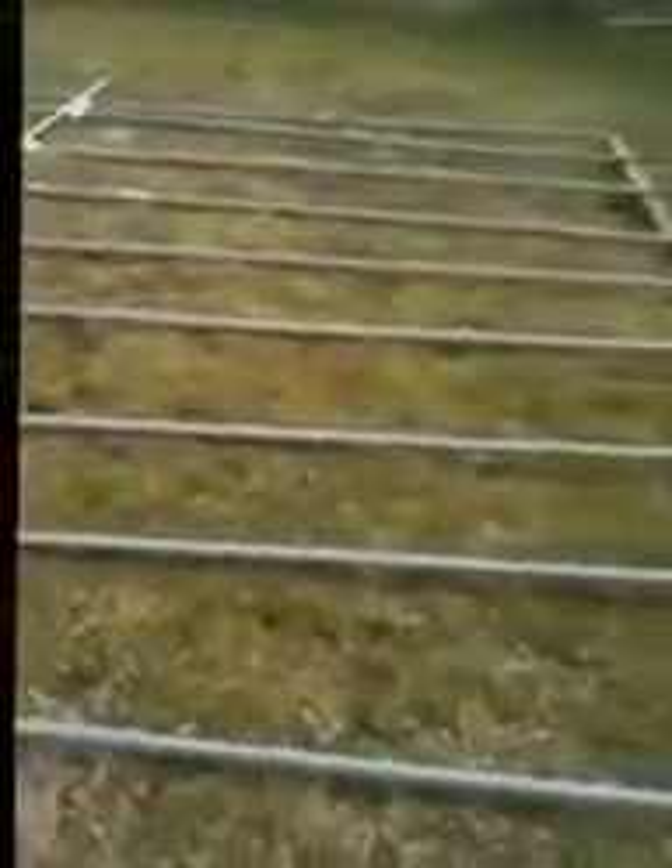Here we are. What I like to do first is take the basic stuff we're going to need and lay it all out, almost like you would if you're assembling a desk or a home theater system — make sure we've got all of our pieces and parts. This is all one inch. I like to use electrical conduit in a greenhouse versus regular PVC pipe because it's more durable and it doesn't get brittle over time. So these pipes here are one inch, ten-foot long sections.